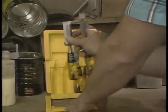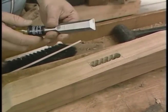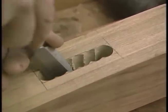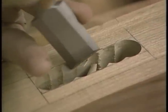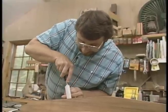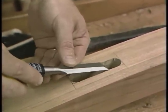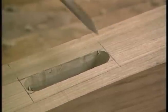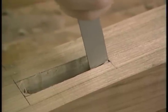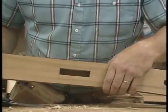Now it's time for some hand work. I need a three-quarter-inch chisel and a one-inch chisel. This is the part of the job that takes some time, patience, and sharp tools. First thing I want to do is remove these little ridges — and I really don't even need a mallet with a nice sharp chisel, you can just shave it right down. This teak cuts so beautifully; I can't believe that just with a chisel and hand pressure I can just shave it away. I'll switch to my three-quarter-inch chisel — it's exactly the same width as my mortise — and I'll chisel out the remaining corners. That looks pretty good. Only 19 more to go.